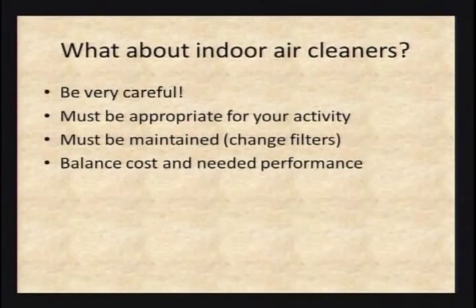You can buy indoor air cleaners. An artist here who works with oil paints has one in her studio. It has a little elephant-trunk-type siphon duct that goes into a box with filters — a particulate filter to capture dust and pollen, a dehumidifier because her basement is wet and clammy, and an organic vapor cartridge made of activated carbon, which pulls solvent vapors in and sticks them to the carbon. The clean air comes back into her studio. She changes the filters about once a year.